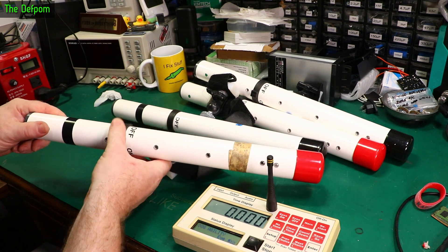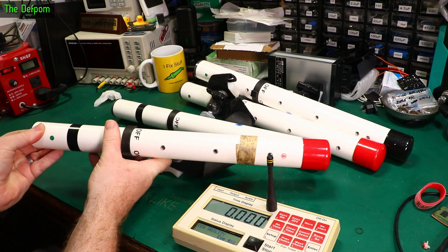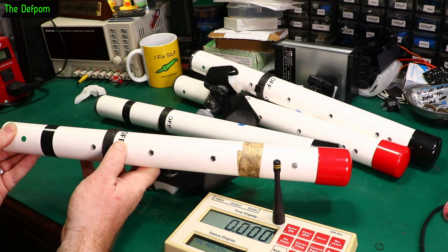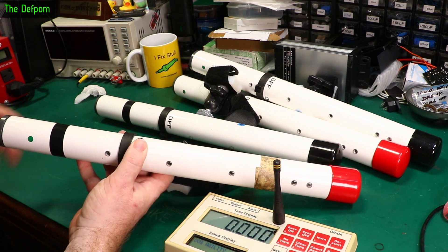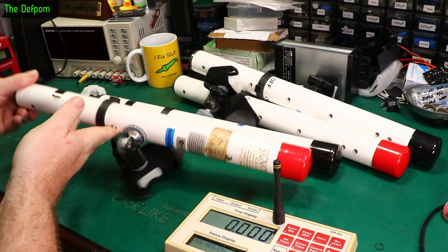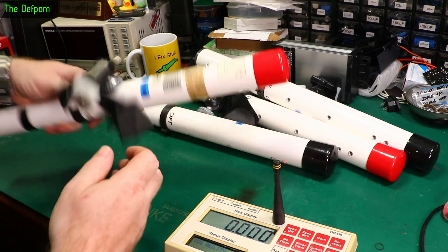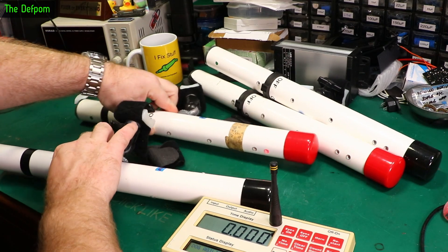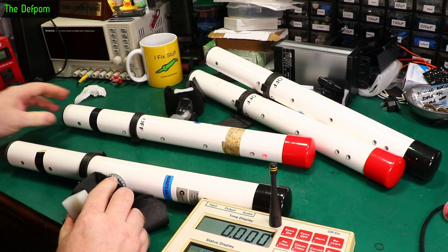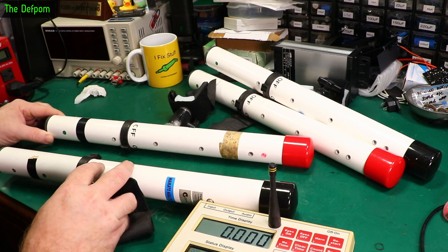Turn it on — and we've got nothing on that one. Could this be bad connections with the battery? Yeah, battery holder bad connections. I'm pushing quite hard on those springs to get it to come on — that could be part of the problem. After screwing it on, we've got a connection. So basically if I point these two things towards each other — you can see the red light there — when they're pointing at each other they should show a green light to indicate a signal, but there's nothing coming up.